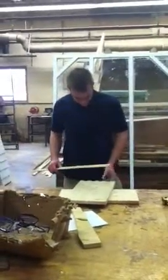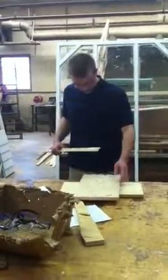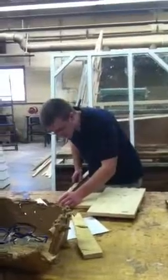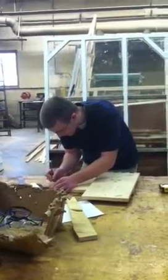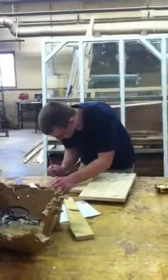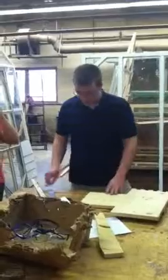When you start out with your joints, you're going to find out that standards are usually an inch wide, and then whatever the thickness of your wood is — which this is 3 quarters — you'll do the depth so that it's a nice even fit. And you're just going to mark each inch. Obviously there's going to be a little over because I don't have the right size dimension wood.